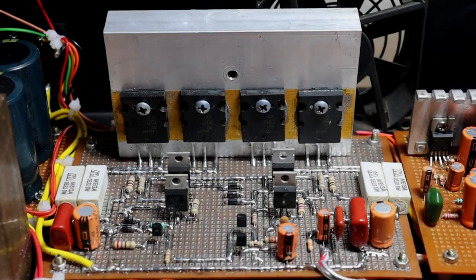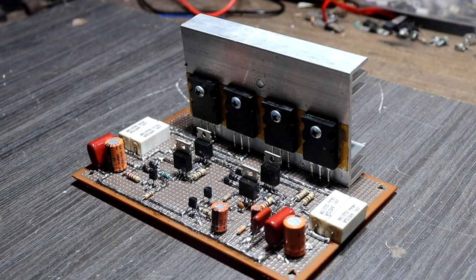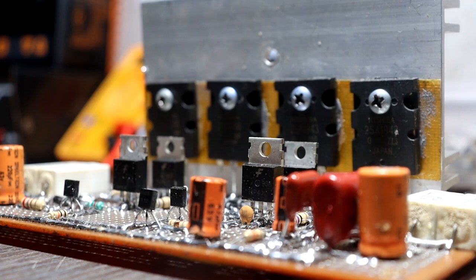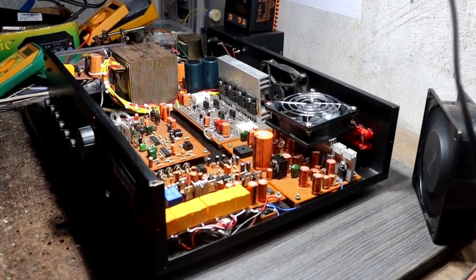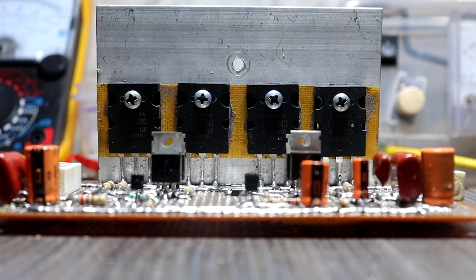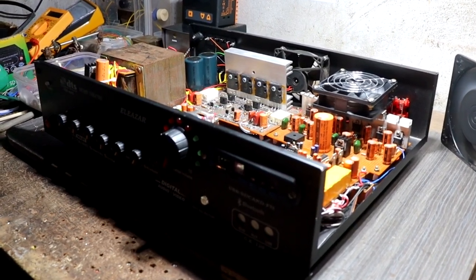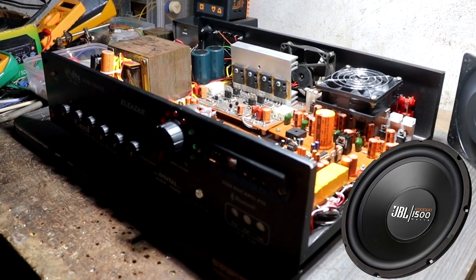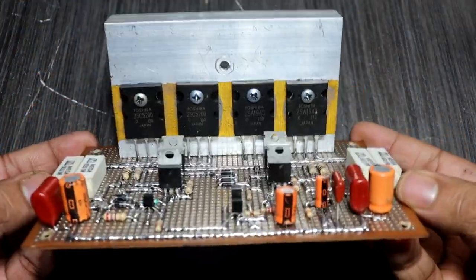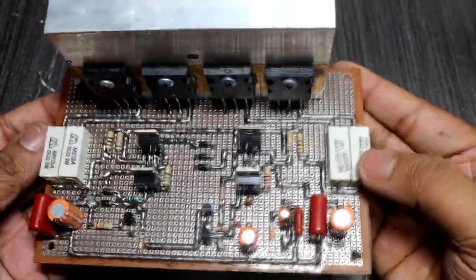In this subwoofer driver I used 4 power transistors, and this is a 200 watts driver. I already published a complete making tutorial video for this 200 watts subwoofer driver on my channel. The video link is available in the video description. This subwoofer driver is based on 4 power transistors: 2SC5200 and TTA1943. This driver easily handles 12-inch subwoofers, and is perfectly suitable for the JBL 1500 model 12-inch subwoofer. This time I placed all components and soldered on the bottom of the PCB board, and I used this 6-leaf heatsink. This heatsink perfectly matches this subwoofer driver.